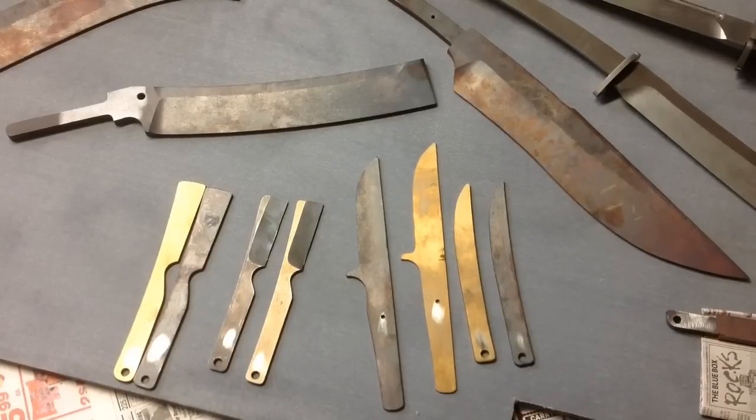So that's about the end of this video. That gives you an idea of some of the things I do when testing out steels. It's a long process to figure out what I consider the ideal heat treat for the type of properties I'm looking for, and sometimes the heat treat varies according to the size of the blade and what it's going to be used for. That's something that Brad Stahl-Smith and I work on regularly — we have a lot of phone conversations, and I've been out to the facility in Pennsylvania a couple of times. We just brainstorm and work through questions: how can we make this better, what can we expect if we change temperatures, soak time, or other variables. We've been doing that with CPM-3V since I started working with Brad in 2005 — almost 10 years — and we've got it to a point where I'm really satisfied with the all-around performance.